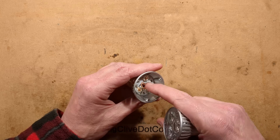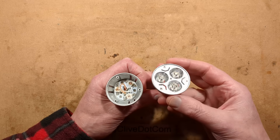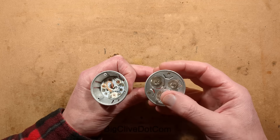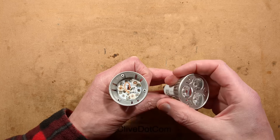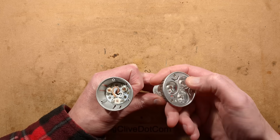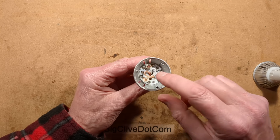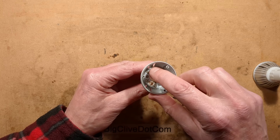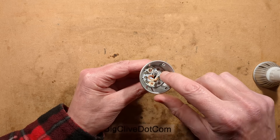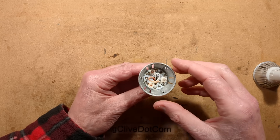If you're not recognising this, it's based on one of the earlier GU10 style lamps that has three 1-watt LEDs on this circuit board, but then three total internal reflection lenses smooshed in by this outer metal plate — a common style. In this case, because I was using it in a glitter lamp and I wanted sharper points of light, I just had the bare LEDs and glued this in with a silicone adhesive into the back of it.